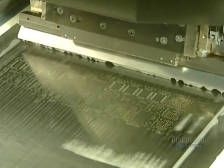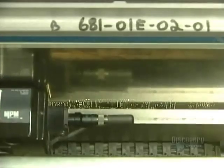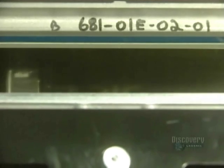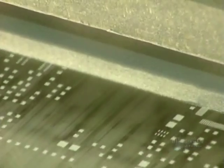The machine spreads the soldering paste which contains, among other elements, a tin-lead alloy. The printing blades go into action, spreading the soldering paste on the stencil. This paste runs through the stencil holes and covers the metallic surfaces of the printed circuit board, which will establish the electric current.